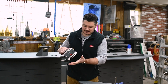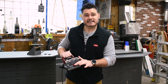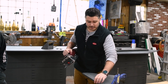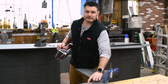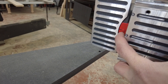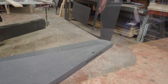So earlier we showed you how Josh used the positioning pins to make the slots on the face of his material. We also have a second attachment called our positioning tab, and this is for making the slot on the edge of your material. For this application, all Josh has to do is drill one single six millimeter hole about 7.5 millimeters off of the edge. He attaches the stop square to the Zeta machine — you can see this little red tab — drops that tab into the hole the CNC made, and now he can plunge in and make his slot, centered right on that hole.